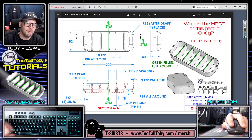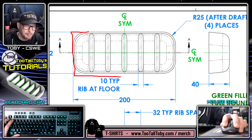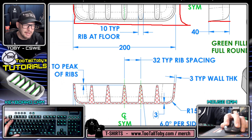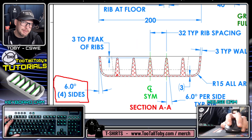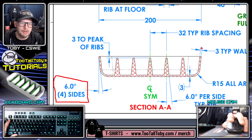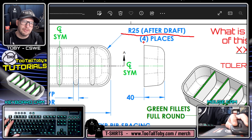Looking at this model, we want to start with a game plan. I think it makes the most sense to start with this shape - I'll do it as a sharp rectangle and then extrude it down to 40 millimeters. Looking at the draft, it's set to six degrees on all four sides, so I can probably do that 40mm extrusion with draft all in the same command. If they were different on different sides, I'd extrude it straight and then add the draft to each side individually. I also notice there's a fillet going in after the draft.